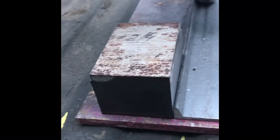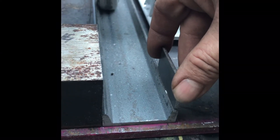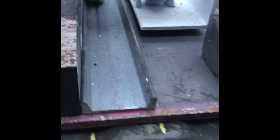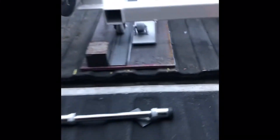There is the lock system. This piece here is going to be welded in place. There's going to be a hole through it, and I'm also going to put a hole through this. That way I can weld this piece in right here, just like this. Once that's welded in, this block is going to be notched right here and it's going to slide on. Then this pin is going to go through that block. That piece is going to be slotted in here and then through this block. When you take the pin out, you'll be able to remove this block and slide it out of the bed.